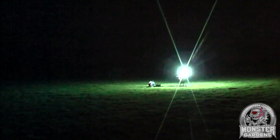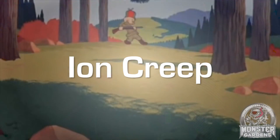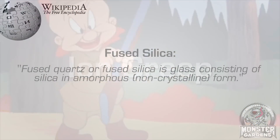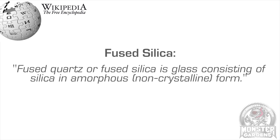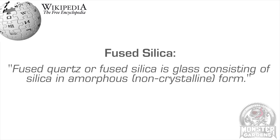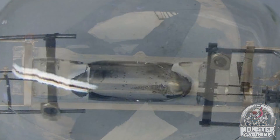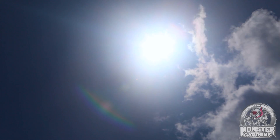The principal cause of metal halide bulb failure is an effect known as ion creep. Ion creep in MH bulbs is a common problem attributable to the use of fused silica arc tubes. The addition of metal halide to the mercury vapour causes some elements such as sodium to migrate to the quartz tube itself, due to intense levels of ultraviolet radiation as well as high rates of gas ionization. This can be observed as the arc tube getting darker or becoming rather opaque, reducing output by blocking light and depleting the available light from the emitting material.